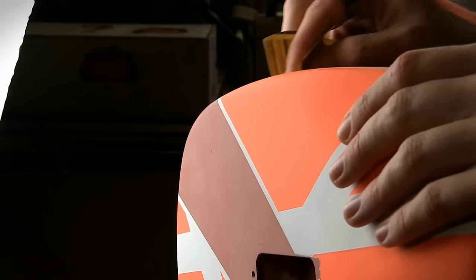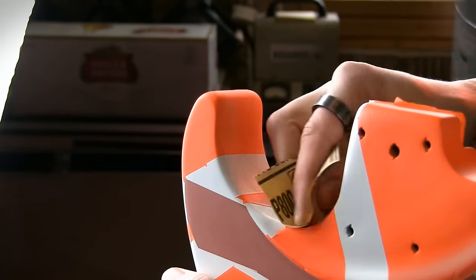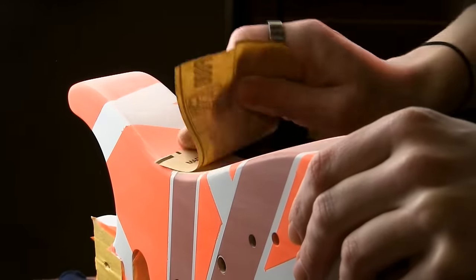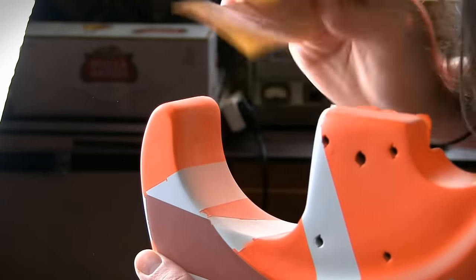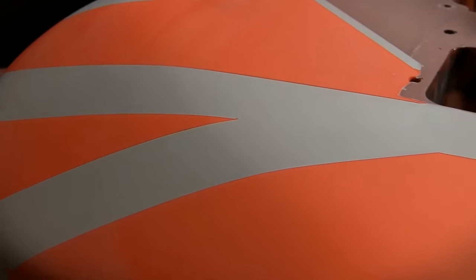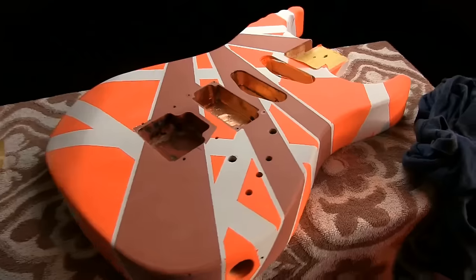For particular problem areas, localised careful sanding should be sufficient to bring these level. The layers of paint were intentionally as thin as possible, especially the white. This was in part to minimise the stepping between the paint layers, but also to allow me to easily sand through to the layers beneath should I want to go for a light relic look. With this guitar being from the 80s and having picked up several dents and dings that I elected not to address, I thought a couple of light sand-through areas would add a certain character to the age of the new finish without being too drastic.